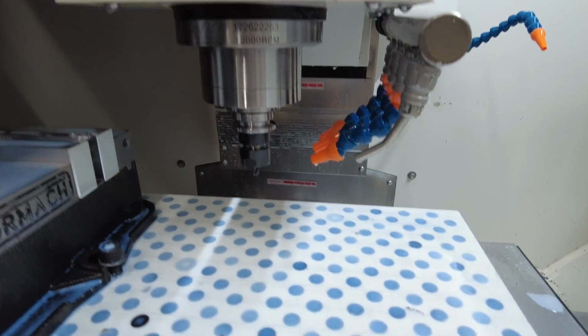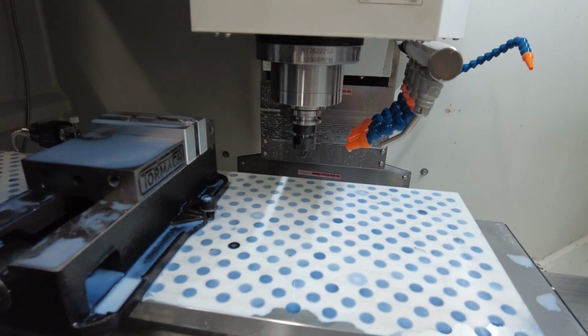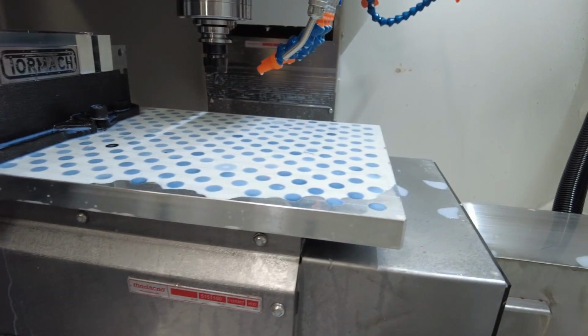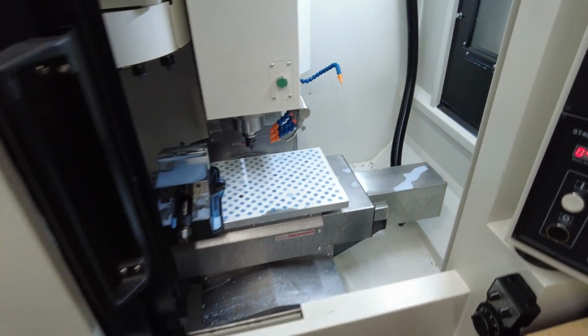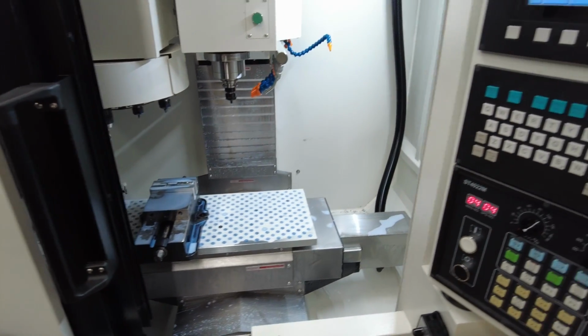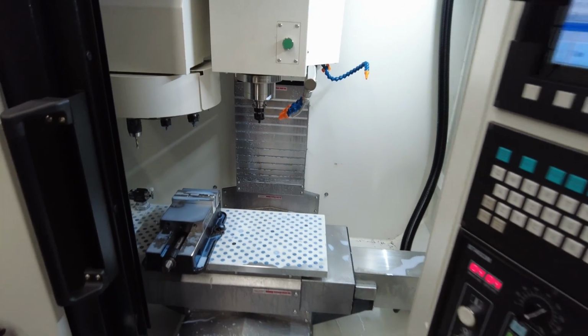So that's a pretty standard tool length. That's about 3 inches of total stick out from the spindle surface. You can see my pretty big gap I got going there. So I found out real quick that those fixtures wouldn't work because they are too short. So yeah, the tools wouldn't reach without doing crazy stick out or buying different tool holders.